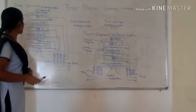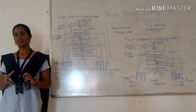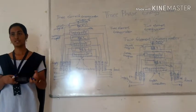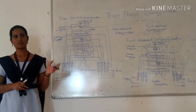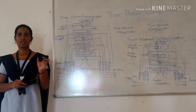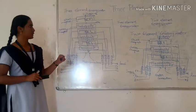The advantages of both the 3-element and 2-element energy meters are that they are very cheap and are strong devices. The disadvantage is that they are only used for AC circuits, and due to the interaction of eddy currents in one element and flux in another element, there will be small errors, but these can be adjusted in both meters.